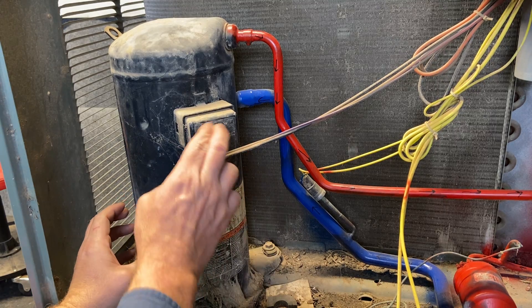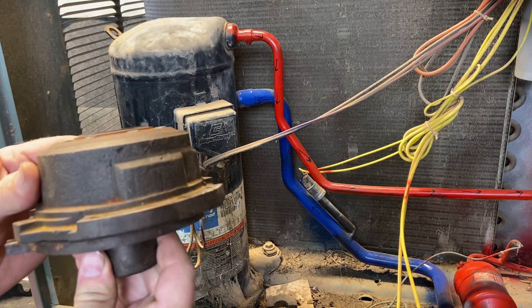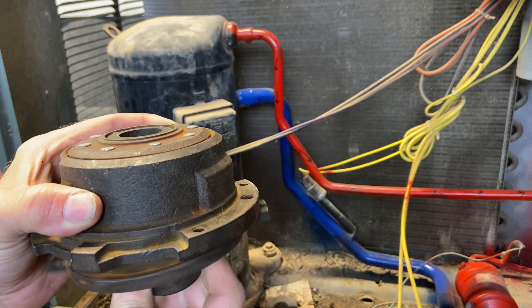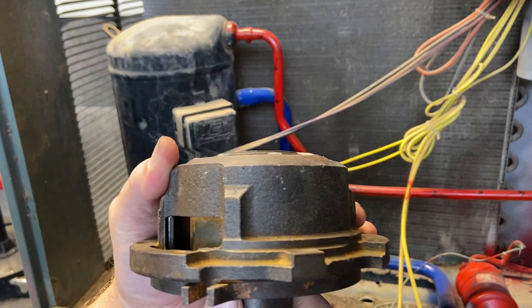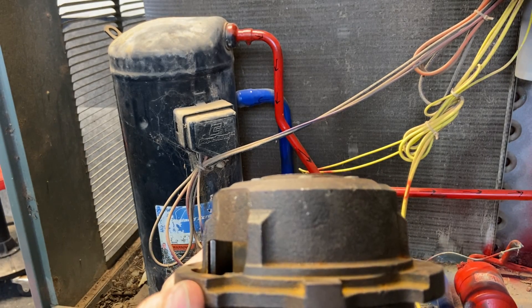The motor side of it is going to be down here, even though the plug is here. So let's look at what's happening inside the scroll. Inside the scroll we're going to have a top plate like this that stays stationary, and this bottom plate that's going to move around. It's not actually spinning — it's going to be moving around and it has these little tracks that it goes on. If we look in the side right here, there's that little gap.